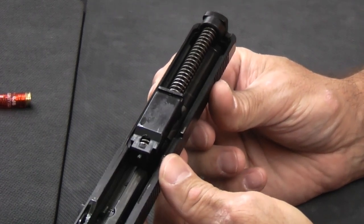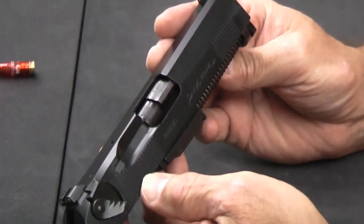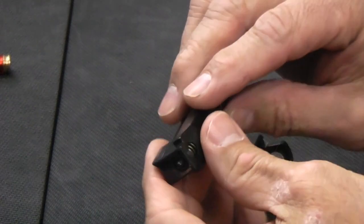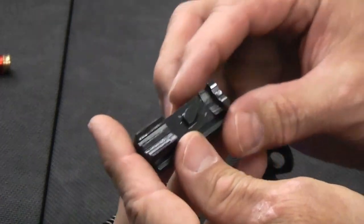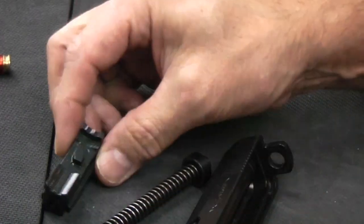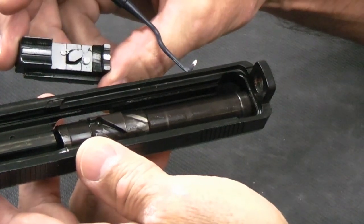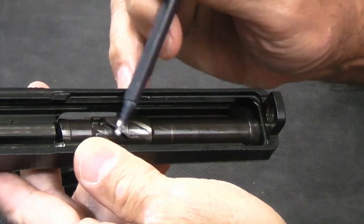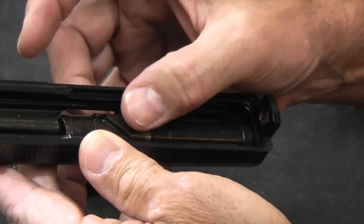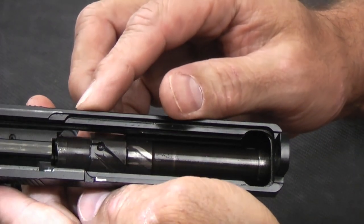It's a four-inch barrel and it does rotate. Looking through the breech, it's a little different than what you're used to. To take it apart, you pull this locking block off — it's under a little spring tension, but not bad. The recoil spring slides through it, and at the bottom you've got a couple of curves and a little protrusion in the middle — this is the mechanism for the rotating barrel. That little star-shaped protrusion slides in here and is what rotates the barrel into locked or unlocked position, exposing a minimal feed ramp. That allows it to chamber almost straight in.